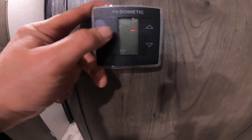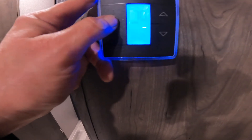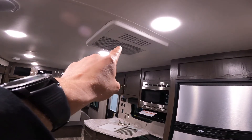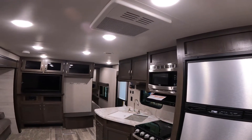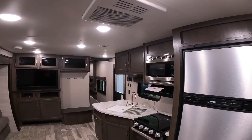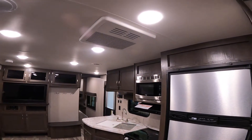We'll turn and take a look at your thermostat. This is a capacitive touch thermostat, meaning you do not have to mechanically depress a button — it's a very light touch to cycle through your options from fan on auto to air conditioning and heat. If your fan is set to high and you attempt to use your furnace, it will always use the fan from your air conditioning to achieve the high fan setting. So if you want to use your furnace without the AC fan noise, come back to the thermostat and make sure the fan is set to auto.